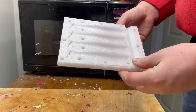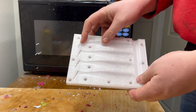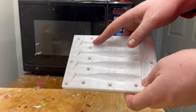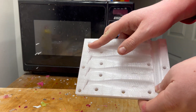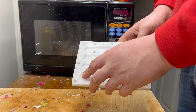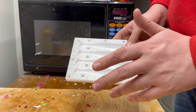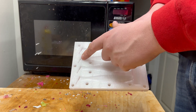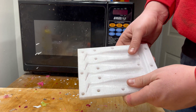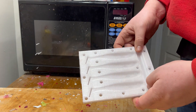We were running into some issues with the tail mainly. It wasn't big enough on the first try, but the main problem was the tails weren't filling up when I was injecting this mold. It took me a couple of tries to figure out what it was. Originally I thought these were too small and the plastic wasn't able to flow in there — that was wrong. I also tried adding a bunch more vent holes, and there's a lot more vents here than my original mold. That wasn't it either.